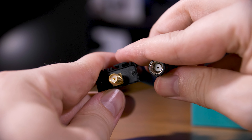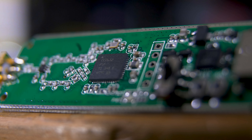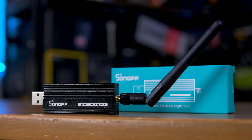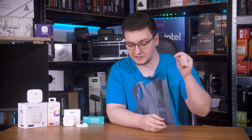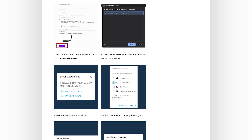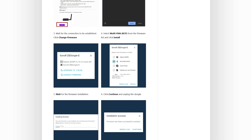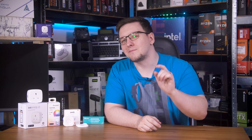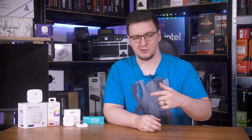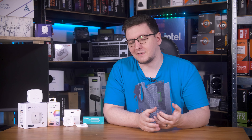You will need the Zigbee dongle-E, which is based on the EFR32MG21 chip — not the CC2652P-based dongle that looks almost identical. You can then head to DarkXST's Silicon Labs firmware flasher website, linked in the description, click on the ZB dongle-E option, and connect to it. You should then get options for flashing either Zigbee, OpenThread, or MultiPan. I recommend MultiPan, as this will let you connect to both Zigbee and Thread devices simultaneously, with very little downside. If you're having trouble with flashing, you might need to install the CP210X drivers, and unfortunately you will need Chrome or Edge — Firefox just won't work with it.